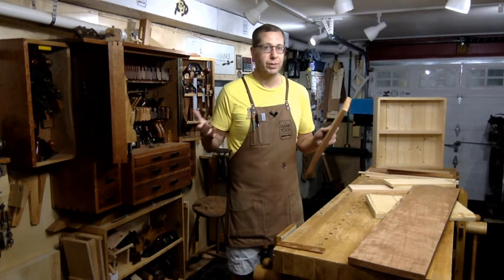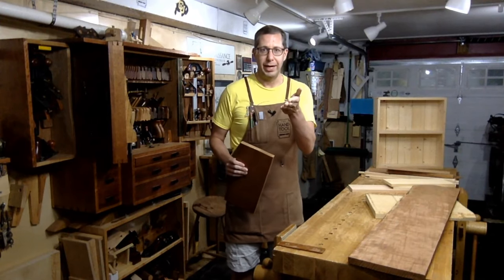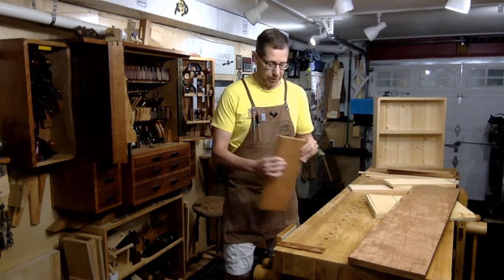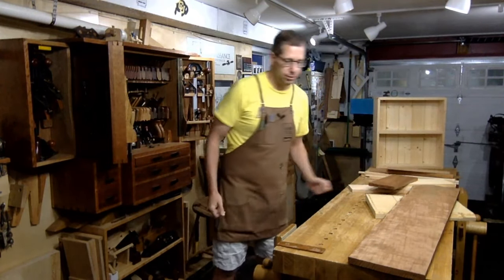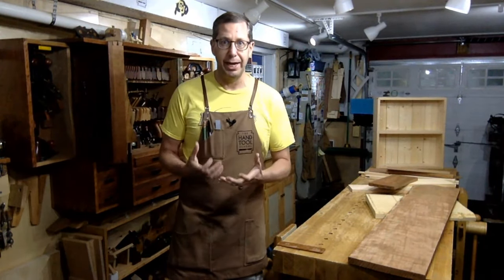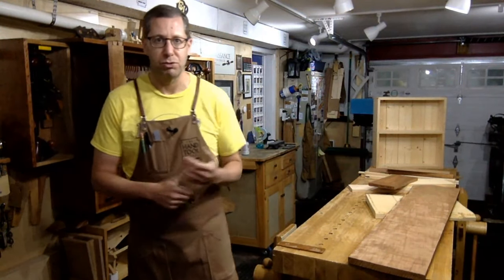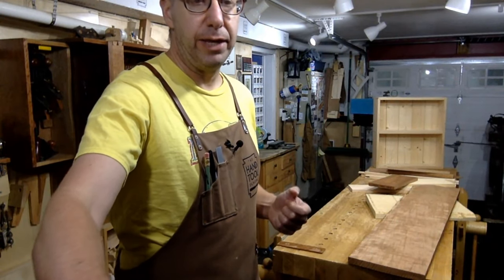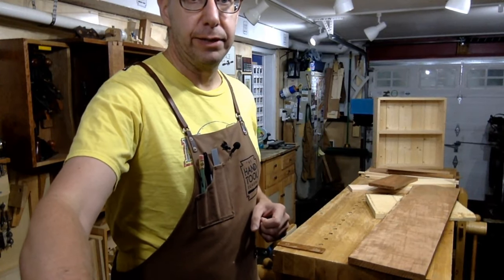Drawer sides, 1/2 inch, 3/8 of an inch thick. That cut is really, really shallow. So while you're sawing at an angle, you're sawing at an angle for like 2 or 3 saw strokes. So the extra step of lining it up, I don't know, I feel like it's entirely unnecessary. But if you are really struggling hitting an angle, that can be a step to help you over that. So just something to think about. I think definitely you will find that you graduate beyond that little idea very quickly.